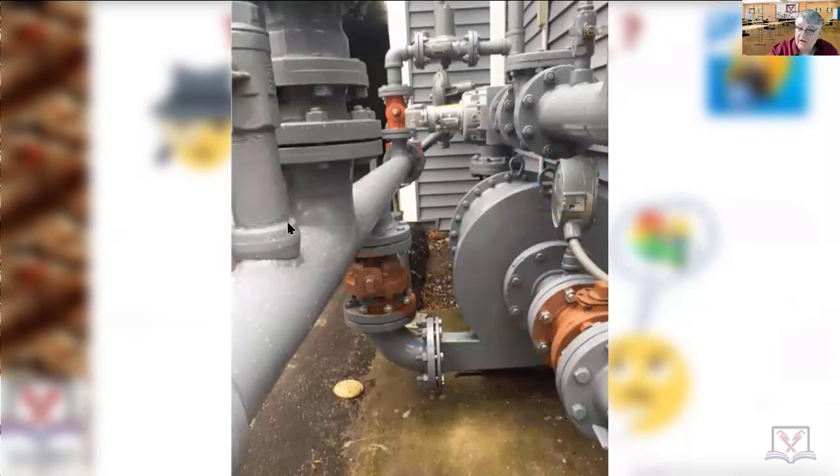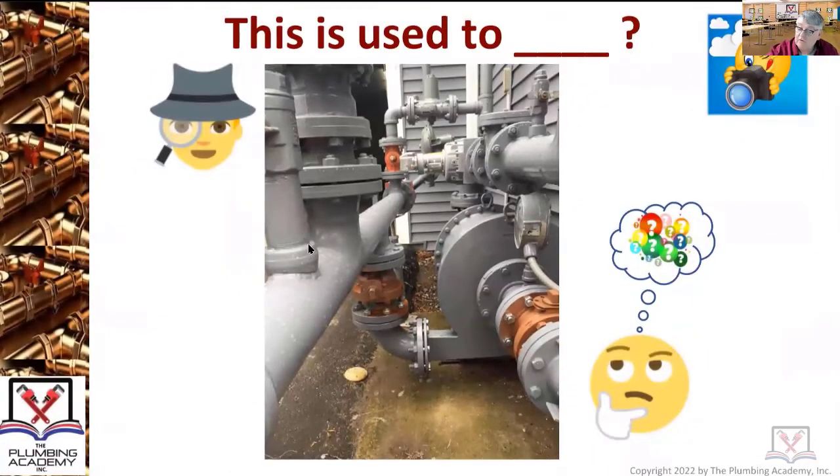There's a shitload of equipment in this building — it's actually a crematorium that has three huge crematorium ovens where they needed to at least maintain 9 to 10 inches water column. And it's on a low-pressure gas main, not a high-pressure or elevated-pressure gas main. So the only option for these plumbers was to put a pressure booster in, and now it's boosting this up.